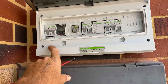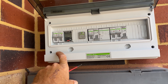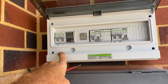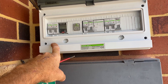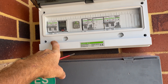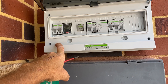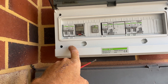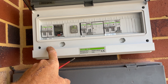I've tested it a couple of times now. The break between the grid going out and the power coming back on is way less than the 15 seconds Fronius say it may take, which is pretty impressive, but it is still a break regardless. That means your modem will shut down and have to start up again, so you may lose connectivity with the inverter, and also means if you have any old-school clocks you may need to reset them on your oven and so forth. But other than that, pretty impressed — good system and easy to install and commission.